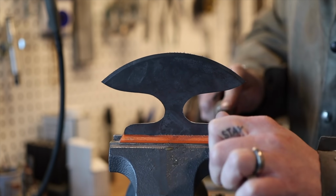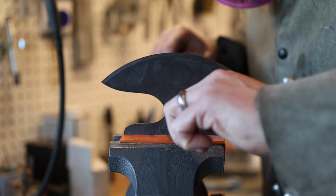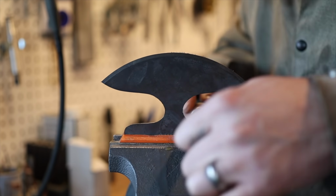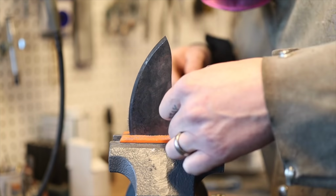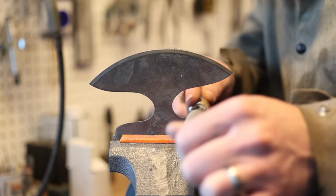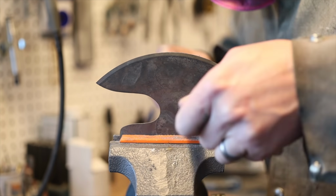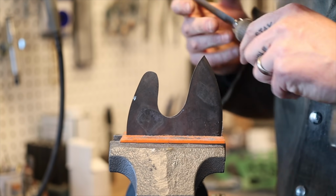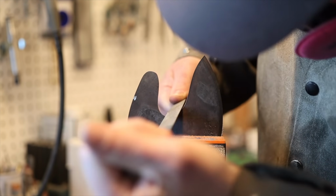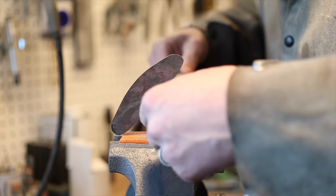After we're done with the die grinder, I wanted to refine the shape a little bit more, and I decided to use some hand files. It's funny, these tools that we started with, that we've always had, even after we get the big belt grinders and all the fancy stuff, I'm surprised how many times I actually end up going to the good old-fashioned hand file. There's something satisfying about this work, it's almost meditative. It allows you to get exactly what you want, and you don't really have to worry about making a big mistake quickly. It takes a while.